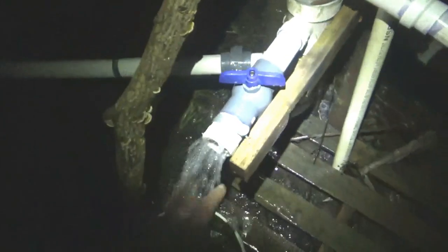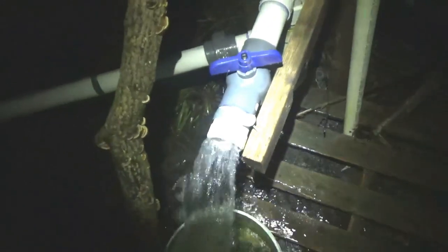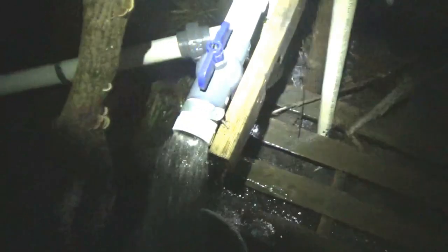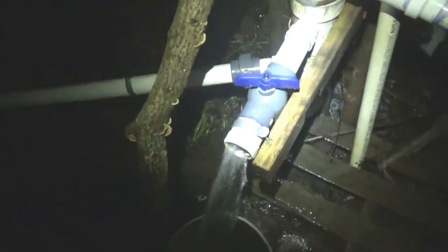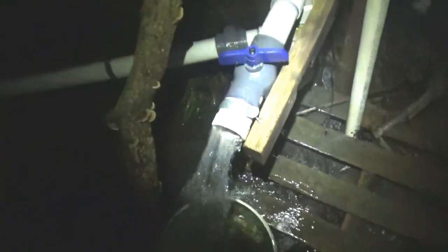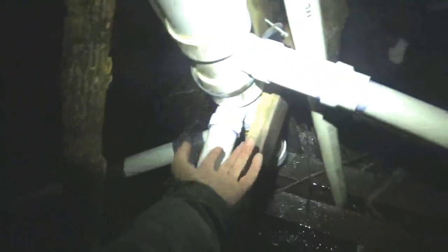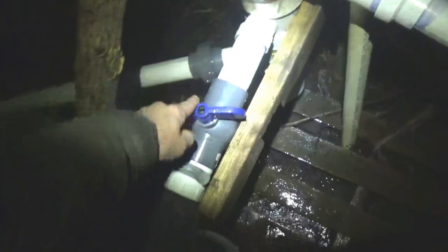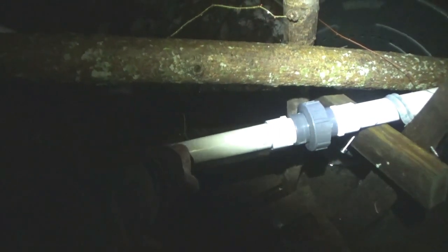The way to do that is keep some volume of water flowing through the whole system all the time. I cracked this valve partially — you can see we're not running full volume here. We're just letting some water run through to keep it from freezing. The rest of the water is flowing: in from the supply line up to the standpipe, out this valve, and out the drive pipe to the ram pump all at once.